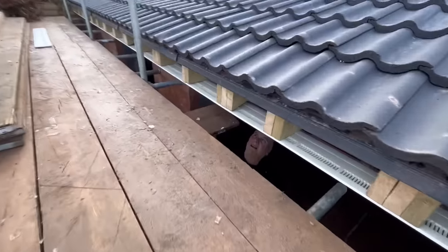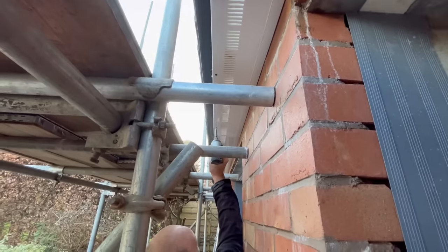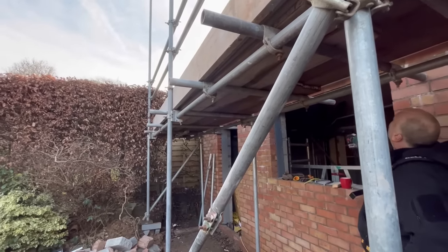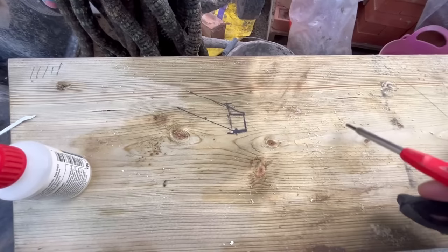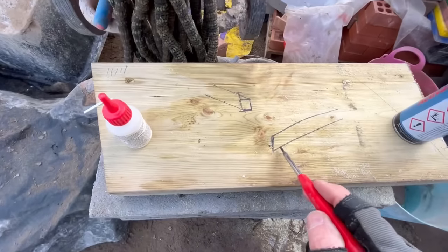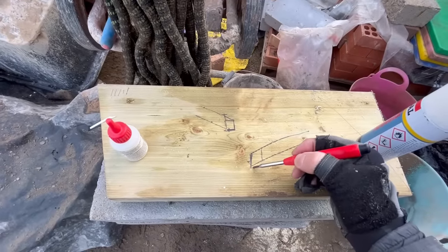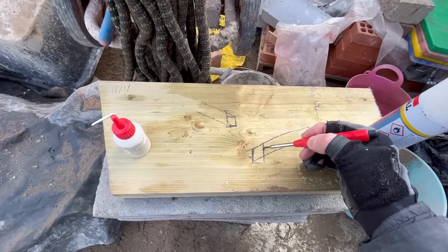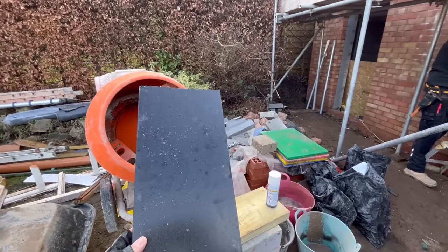Mick's just putting the screws in. Going underneath now - other than a little bit of a wipe because it's a bit mucky, that's on there all the way across. We've decided to do a box end over there. The barge comes down like that, then down to there, and this part you then have to make up a bit of a - I've cut the barge off, and then we've got a piece of this, nine inch, and we've gone a cut piece like that. Normally what you can buy is a piece of this - they come in two metre lengths, about 600mm wide.